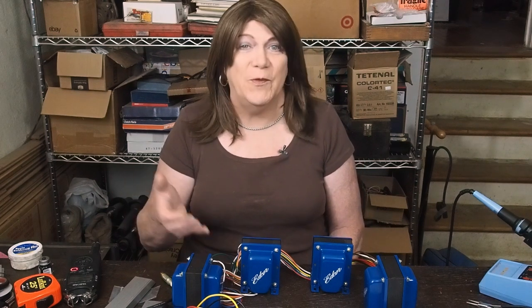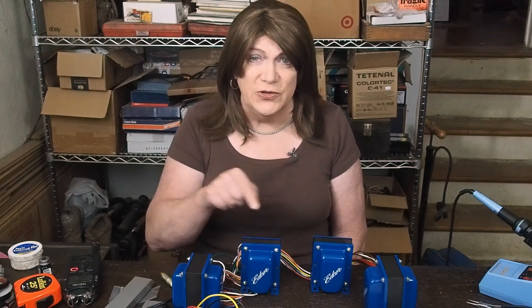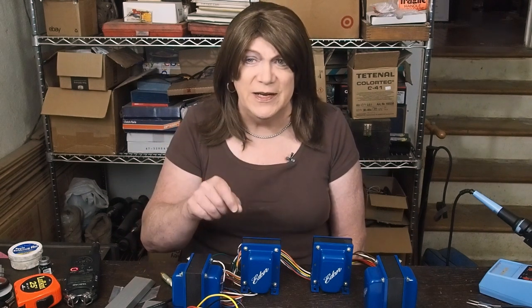You can't make something that's going to make less noise than nothing. You can't have a power cable that's going to suck the background noise out of the room to give you a blacker noise floor or whatever they call it. I'm just stunned that people fall for this. That's why your power supply is there. Once it goes through the first LC or RC filter, any radio frequency or anything outside of the audio range is going to be filtered out. The really heavy-duty noise coming into your amplifier is the 60 Hz AC at full amperage. If you're not hearing that 60 Hz inside your amp, you're not going to hear any of this other stuff either.